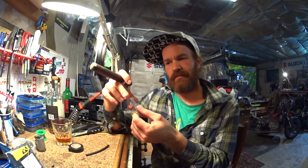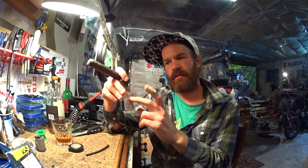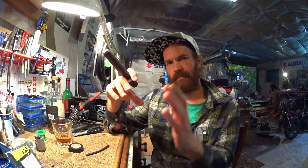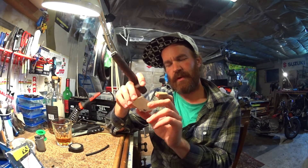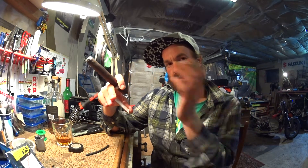I haven't made much video material because thinking doesn't really make good videos. What I've been thinking about is ways to get a more reliable engine RPM pickup. I've been testing a neon bulb and a photo transistor together for optic coupling and good isolation between the noise maker and the Arduino. The problem with the neon bulb is that it's too dim in this setup to trigger a photo transistor properly.